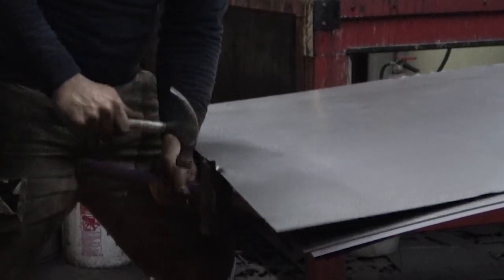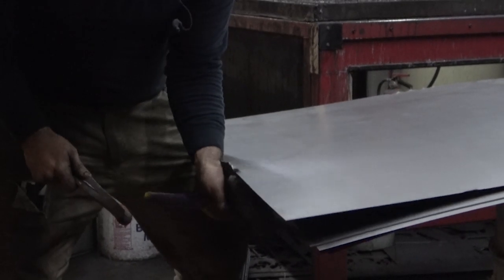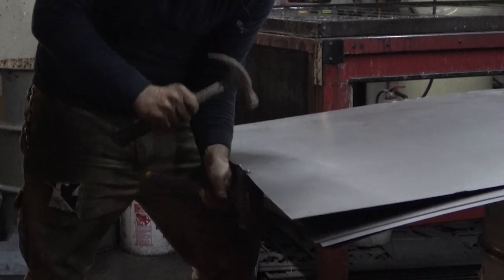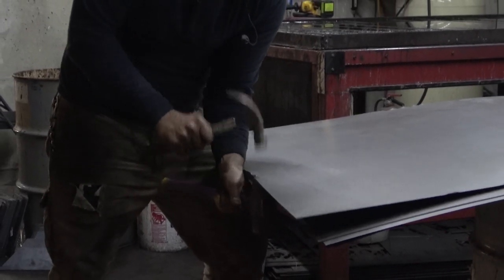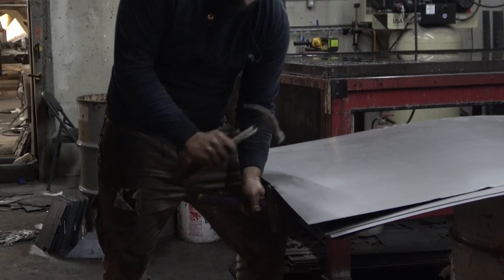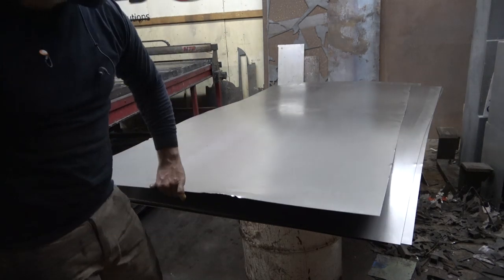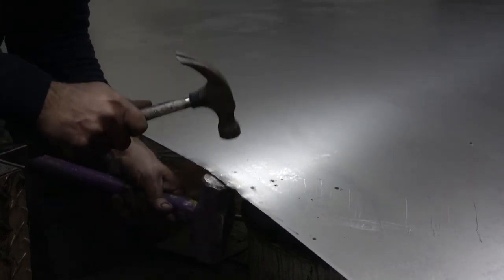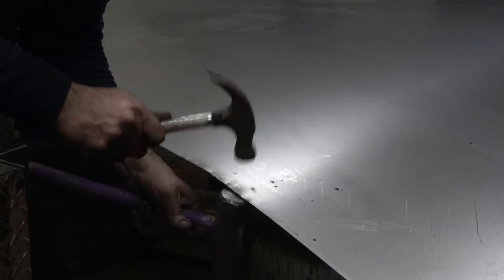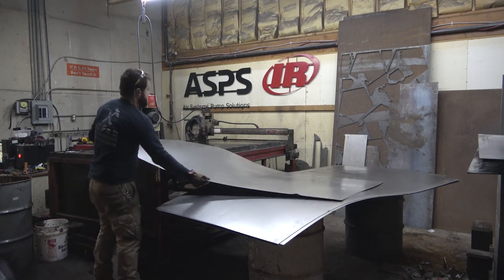My trick here is to let the anvil more or less float. As I'm hitting the metal with that diagonal blow from the lighter hammer, I'm not forcing the anvil up, so the metal has a chance to deform but isn't being struck against something real hard, flat, and resistive in a way that would leave hammer blows or imprints in the steel. It's flat enough that we can work with it. This one's also got a second spot down this edge that's kind of messed up, so we'll do the same. With a closer look, you can see I'm really letting the anvil bounce — I'm not pushing up on the bottom of the sheet very much. The anvil's really just there to spread out the load as it's applied, so you're not punching new dents into the steel.